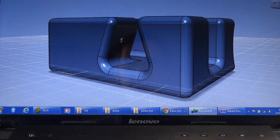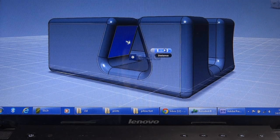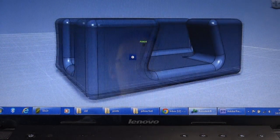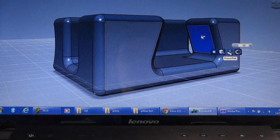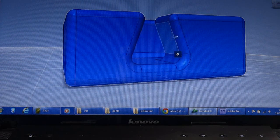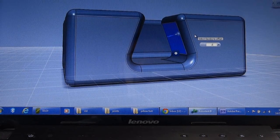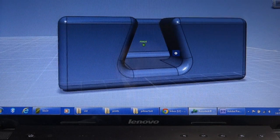Fortunately that's quite easy to do. All I have to do is grab this surface and move it back by about 10mm, then look at this one and move that out by 10mm, which hopefully sets the groove more in the middle. I also need to move this one out slightly, so let's go back by about 2mm which will give me 1mm extra clearance on each side. It's not quite in the middle still, but we can adjust that and then print another version.